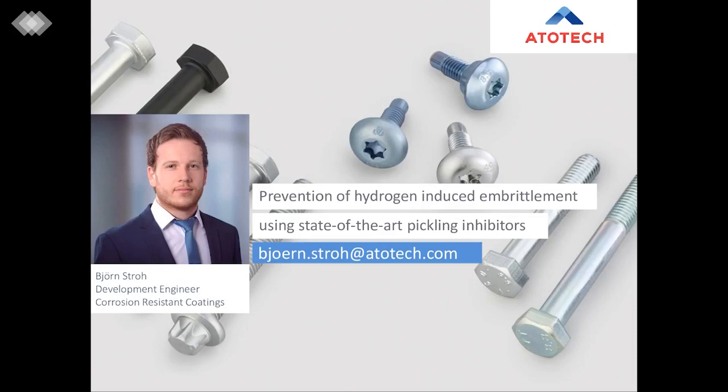Okay, thank you. Has the inhibitor to be replenished separately from the acid? So in general, the normal bath replenishment, when you check the acid power of the pickling bath, should be enough, so the pickling inhibitor can be replenished together in the same ratio.